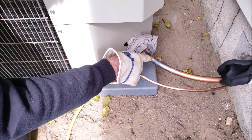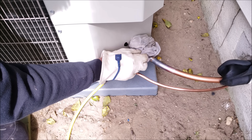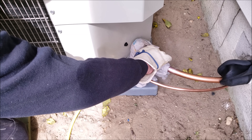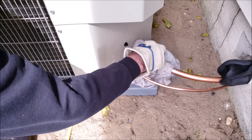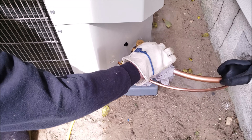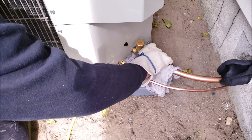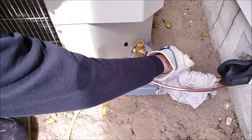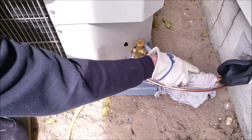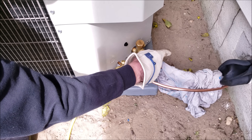Once this changes color, then it's safe to go ahead and wipe it with a wet rag — there are no bad effects from doing that, so we're going to go ahead and cool it down as quickly as we can. We made sure that we had a little bead going from the outside of the tubing to the actual tube, so the braze is not going in and then coming back out. You should be able to rub your fingernail on there and it doesn't get caught, which means you have a nice little bead on the outside.